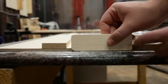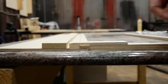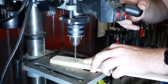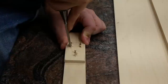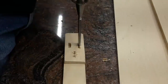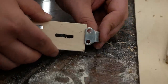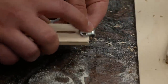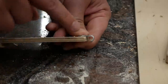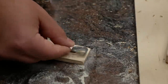The next step is to drill three slotted holes into the top of this to fasten it to the measuring rail. The hook for the toggle clamp latch thing is going to attach right here, but as it is right now this hook is just slightly thicker than the plywood, so we need to take this over to the bench vise and smash this down a little bit.